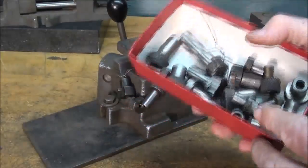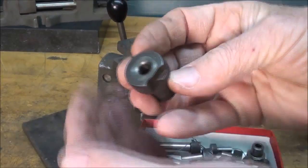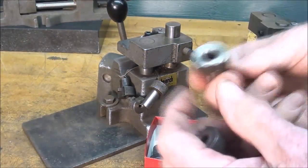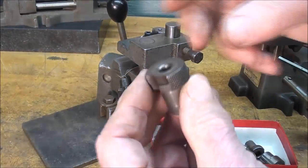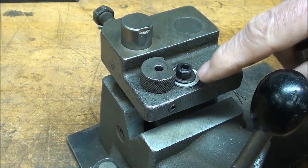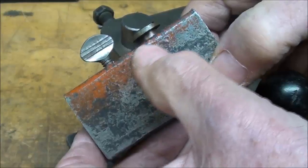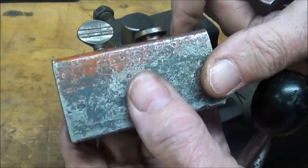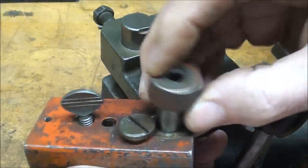There are a lot of factors to consider when you order your drill bushings. You want to order them with this little machined area here. These are hardened — very, very hard — and will last many years. Not all of them have this little machined area and you'll see why in just a moment. This drill jig is missing the correct screw and I'm just using a washer, but this is the type of screw that should be used — they're made specifically for these drill bushings. They're hardened and they're a shoulder bolt of the right diameter, both on the head and the shoulder, which allows you to quickly change the drill bushings.